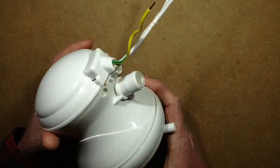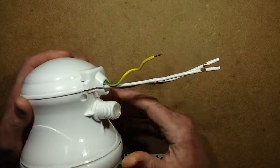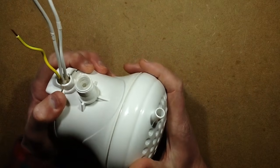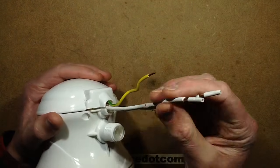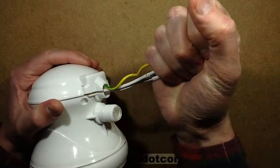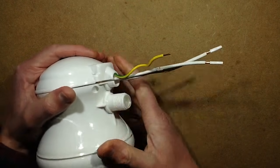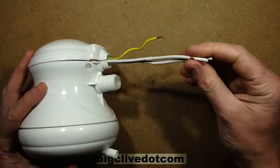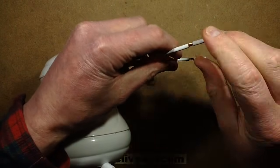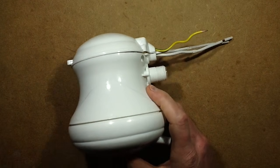Interesting device. It's got two cables going in, and they're very short. This is a 5 kilowatt unit on 220 volts, so it's going to be about 20 amps — fairly beefy cables. It's odd that they don't include a longish flex on it; I'm not sure why they do that. But most of the videos and pictures you see online show these wires just twisted onto terminals, or a bit of tape stuck around them and the wires just twisted together — it just doesn't look right at all.